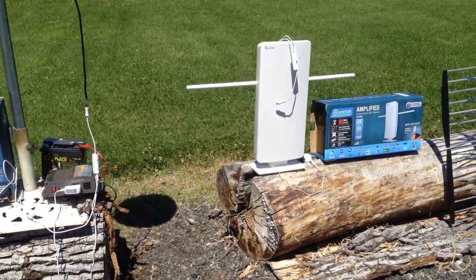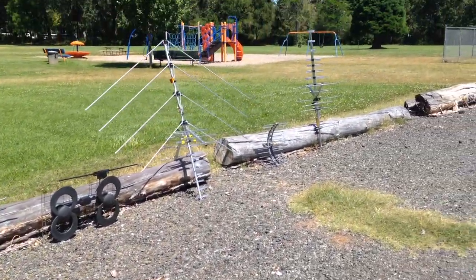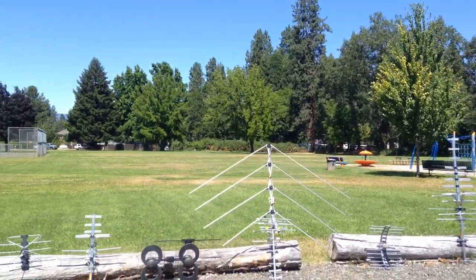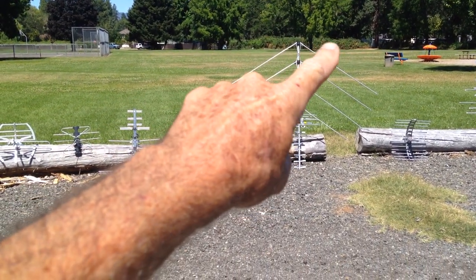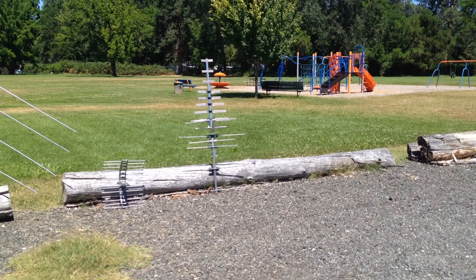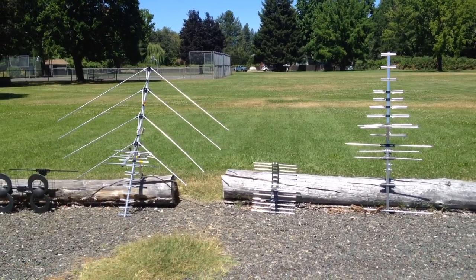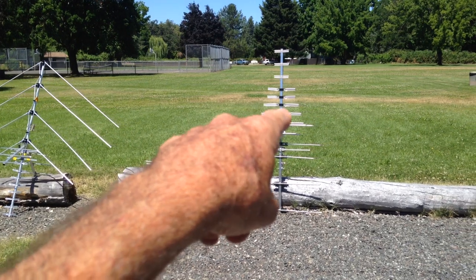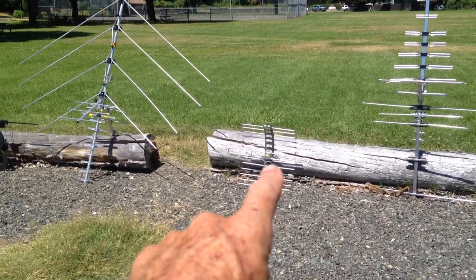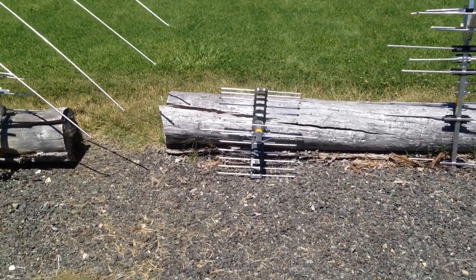There's no such thing as a digital antenna or an HD antenna — antennas are antennas. It all comes down to what frequency you're trying to pick up and which antenna is designed for that frequency. For VHF signals you'd want an antenna with longer elements like these. This is the Channel Master Advantage 45 and this is the Winegard HD 7694P — both designed for UHF and VHF. I find the Channel Master does better on Channel 5. This is a UHF/VHF antenna made by GE, the GE Pro, which they refer to as an attic mount.